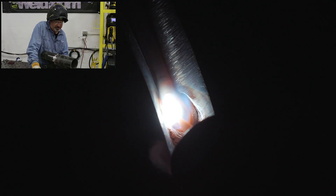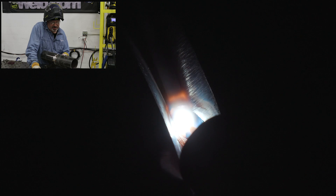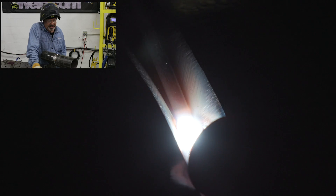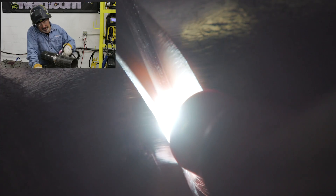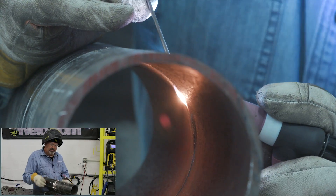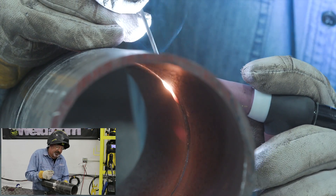I'm going to heat the leading edge of this groove up. I'm trying to keep the wire on the leading edge and down low in the groove. My personal preference here is to rest the cup gently in this groove. I have a number five cup and I like to just do the wiggle thing when I'm doing this in quarters — that way I can come up on top. I intend on blending into this tack up here, heating it up, pushing some wire in, and fusing it all together. I might be slightly over the top when I get there and that's fine. Again, this is to build confidence.